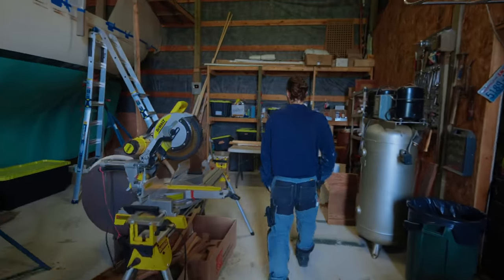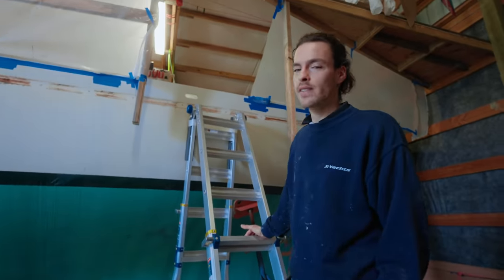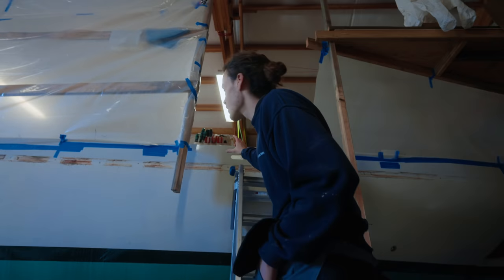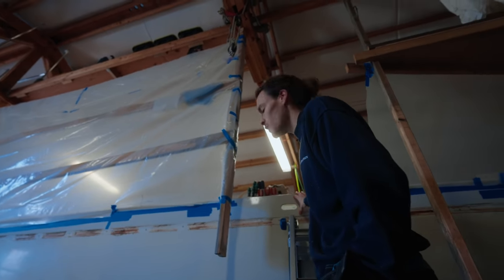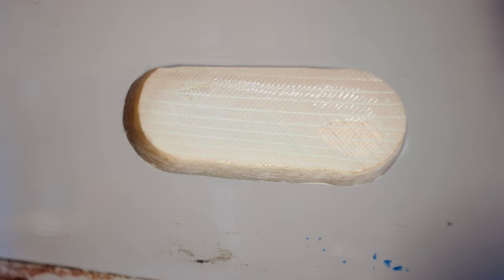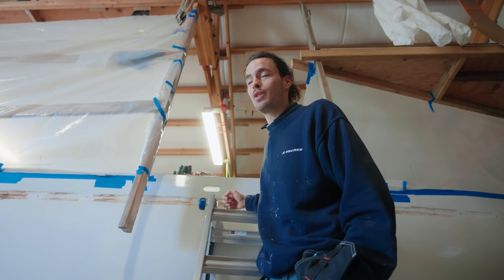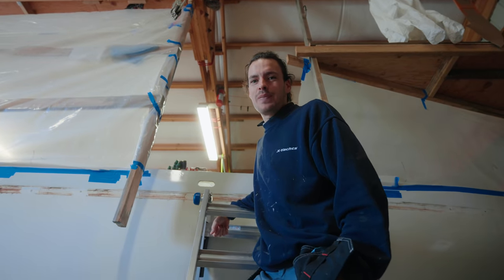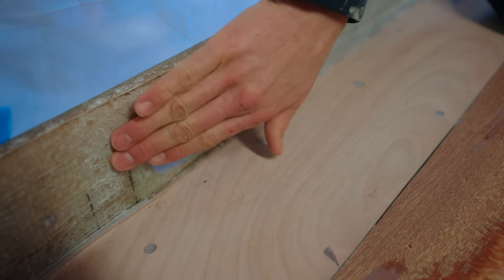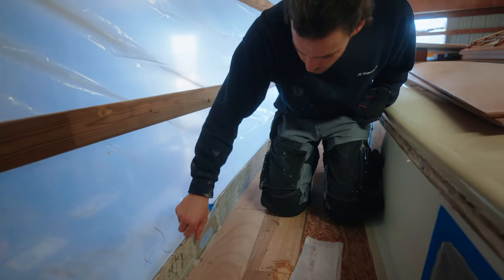He's refit a lot of these boats and has done this bulwark job many times, so he knows what he's talking about. Exactly. So this is also a step that will help when we put on the bulwarks, because those get smushed against the hull, against this portion of the hull from the inside with a lot of putty. So having this glass in place helps with this step as well. But the preparation involved now is that whenever you glass things, even when you use peel ply, you still have to do a little bit of prep work. Oh, I see. Yeah. Not bad, but a little bit of scuffing down here.